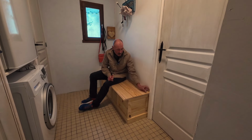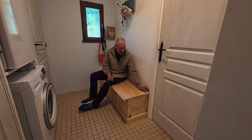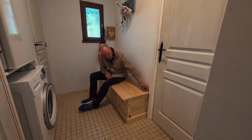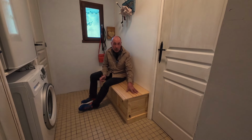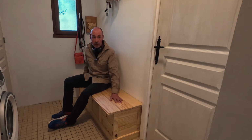And then I'm going to have to make a bearer at the back, cut this one down, probably a 2-inch width, some pocket hole screws in the back so I can screw this bearer down, and then I can hinge it along that line, and then I can make the top out of what's left. So that's the plan. Right, let's go and do some cutting at the saw.